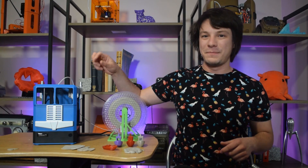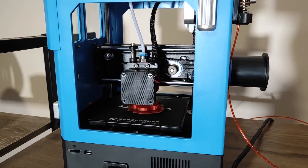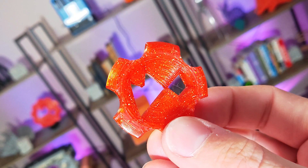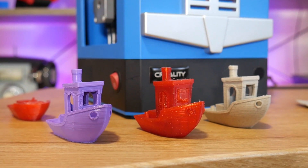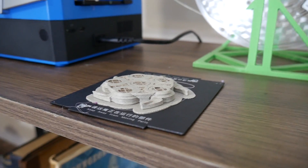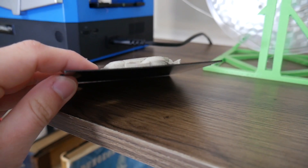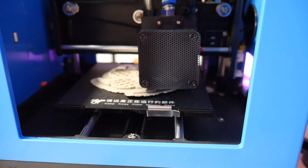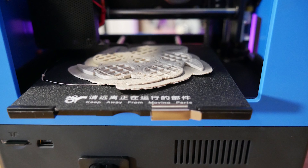Overall you can get away mostly with these three interface buttons, but if you home the bed and try to load filament you can't bring the nozzle back up, which is really frustrating — it should home and then raise again since it homes before the print starts anyway. Print quality is not the most important factor for a child-friendly machine. The CR100 handles simple prints fine, but they clearly show cooling issues and print accuracy problems. I couldn't even test clearances because the PLA warped the spring steel plate so much it came loose from the magnets.